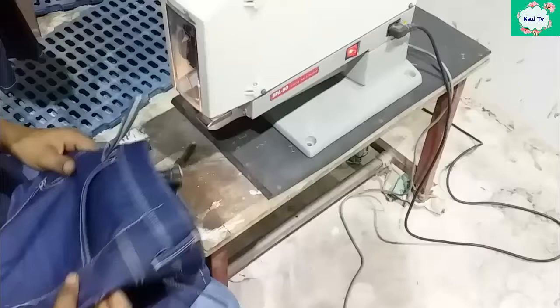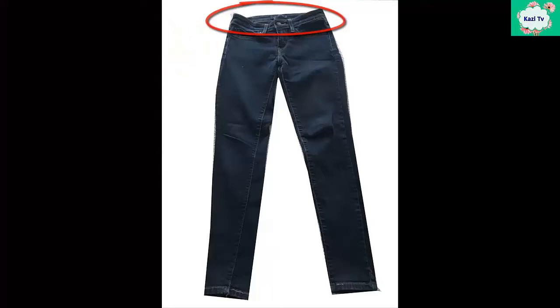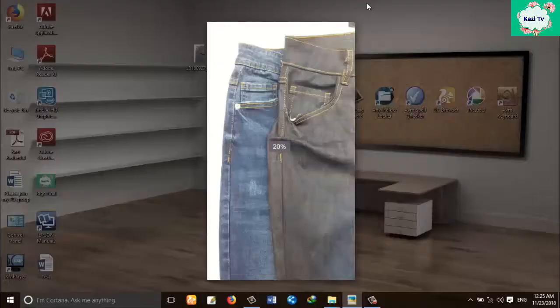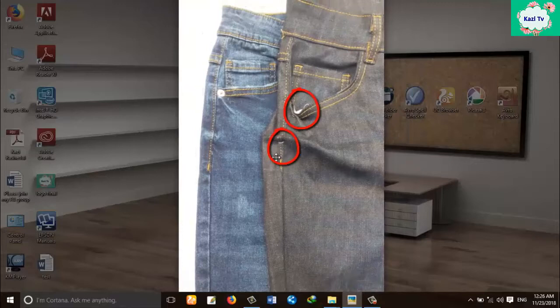Tagging is a process which is done by a swift tag machine with the help of a plastic or nylon tag pin in rigid form garments to get a very heavy contrast on the waistband, bottom hem, back pocket, and front pocket corner. After completing the wash cycle, it must be removed from the garments before softening. In this picture I am showing you two samples — one is washed and another is unwashed. You can also see two tags here. After washing, the tag is removed from the garments, and it looks like this.